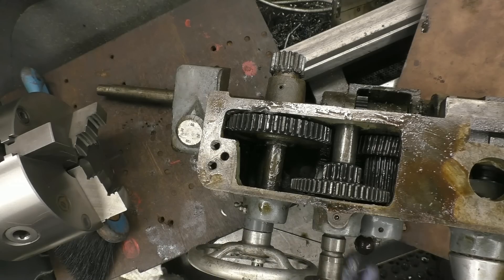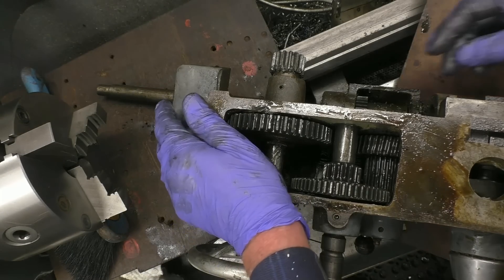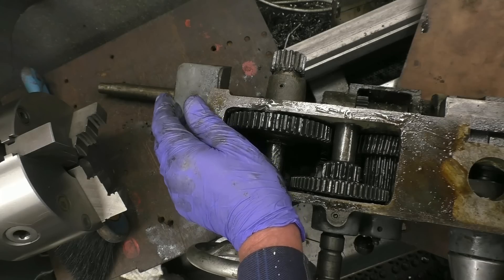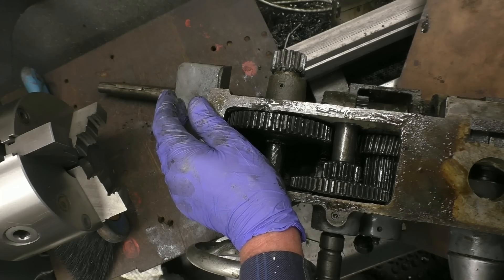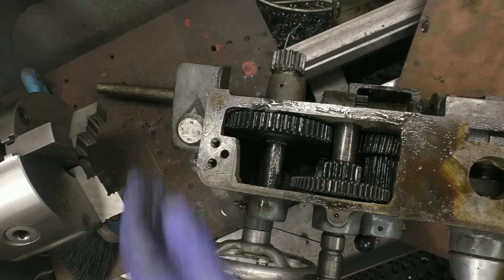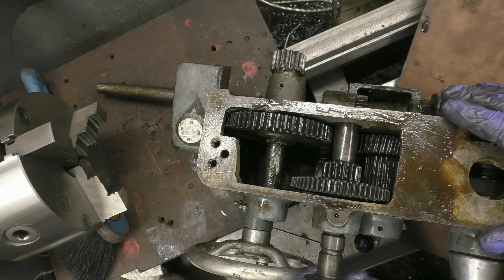You can see it's nice and oily. It hasn't got an oil reservoir in it but it has got oil points and I keep squirting oil into it — it's just been lucky. It was just a busted chip that got stuck between those two gears. I was expecting to see stripped teeth, bent pins, and all kinds of horrors. Basically it's not too bad. I just wish I'd looked before I started stripping it down — I would have learned quite a lot about it. But I'm quite happy with the way it came to pieces and happy with what I found — at least I found something.